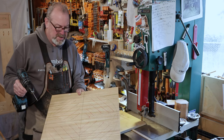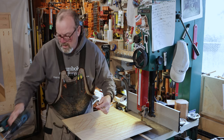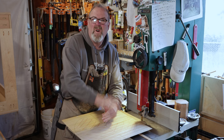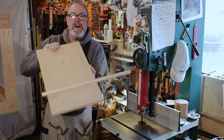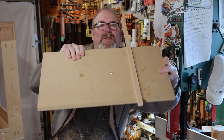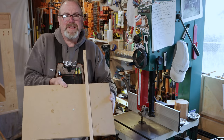Next thing I'm gonna do real quick is just drill this hole here. If you're ever trying to drill a center of something, take an awl, put it right on the center where you wanna go and give it your awl, like that. That'll help you make this work a little better. Boop, just like that. Now I'm gonna countersink this thing. Yes, sir, that looks good. See that?